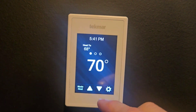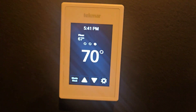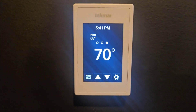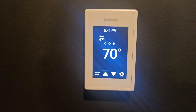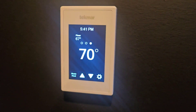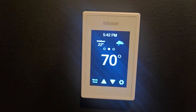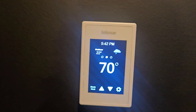On the main screen you can scroll over. It says heat to 68, but you can see it's 70 in here right now. It'll also read you the floor temperature. Because I set the sensor in a cooler spot in the slab — due to the 10-foot wire limit reaching back to the thermostat — it reads slightly colder than average. So I went in and set a floor temperature offset; the floor is probably reading about 64 but I adjusted it to display 67. Scrolling further, it shows outdoor temperature — pulled automatically from your location's closest weather report when you connect to Wi-Fi. Really nice feature.